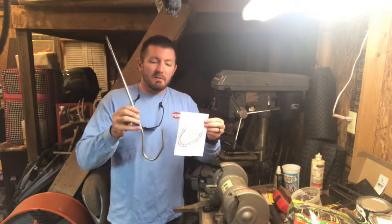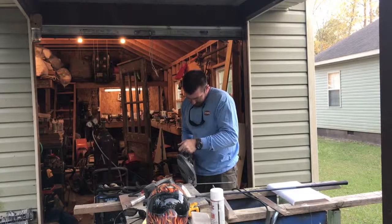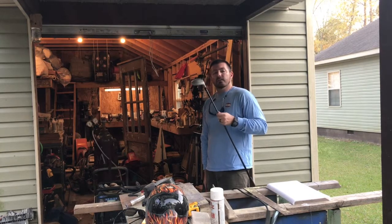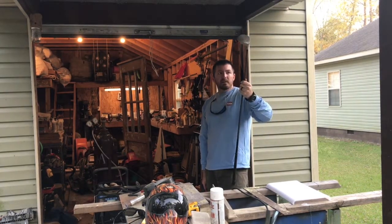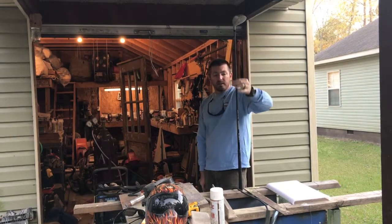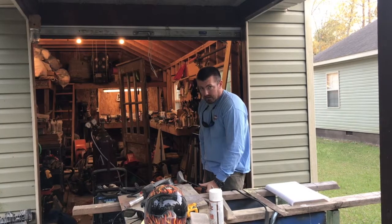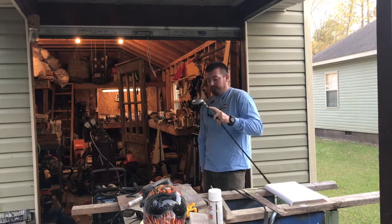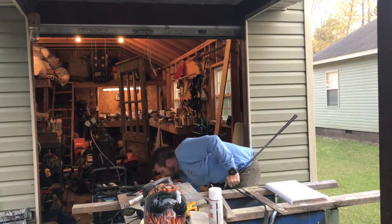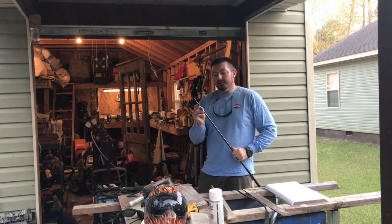The rod is bent in the vise and you can see it's right on our drawing. We're going to cut this end off right about there. I'm going to use the port-a-band to cut the end of this golf club shaft off as well. I want it as long as possible, but I don't want to have to grind a whole lot off my gaff hook. The shaft gets wider closer to the handle, so I need to find a good compromise between the quarter-inch diameter of my hook and the shaft diameter, and figure out how much I'll need to taper that end.